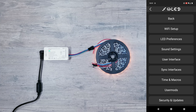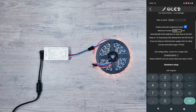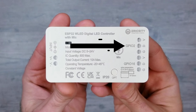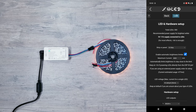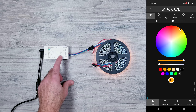Go into Configure and then LED Preferences. Since we're using JST clips in this setup, I'm going to keep my brightness limiter set to 4000 milliamps, which is about what most of these connectors are rated for. Since we're using the WS2815 LEDs, we can keep the strip type set to WS281X. GPIO has already defaulted to 16, which is what we used, but if you connected to GPIO2 on the controller, you would change this to 2. We currently have 300 LEDs on this strip, so put that number in, scroll up and hit save, and all the lights should now be lit. There's also a button on this controller — one push turns the lights on and off, a long press cycles through different colors, and this button can be reprogrammed to activate any presets you've saved.